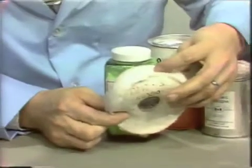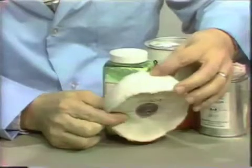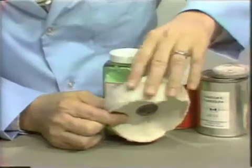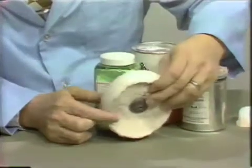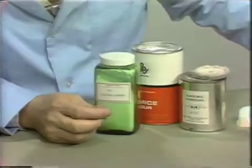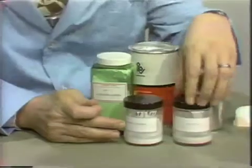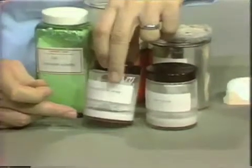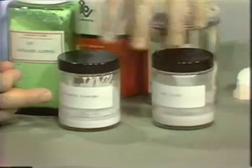The second wheel is a non-stitched rag wheel made by Dixon and is lead-centered. This particular rag wheel is very, very soft, and the non-stitching will give you a very high glaze and a high polish. It's a good idea to mix these materials and put them in little glass jars — you can use baby food jars, for example — and mix the material with water and leave this on your lab bench so you'll always have it ready for polishing when you need it.